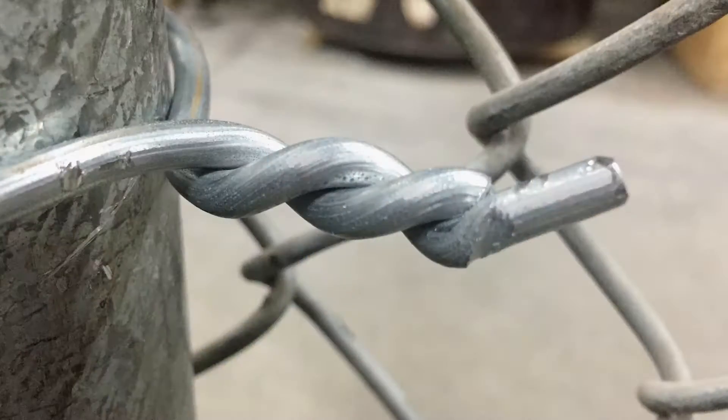But the difference you're going to see there is the tail. In the twist — the barbed twist — we always have one side that's cut off. And where that exactly shears off, sometimes it will hinder that little last hump that you're counting. But if it did not shear that last one off, you would have to cut them off, which would then shorten the tail even further. Or by shearing it off, it makes it pinch so tight there that it's very difficult, virtually impossible to twist. And I'd like to see the guy that can actually untwist it by hand, especially with the six gauge ties.